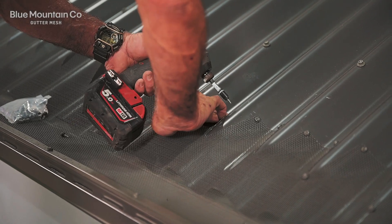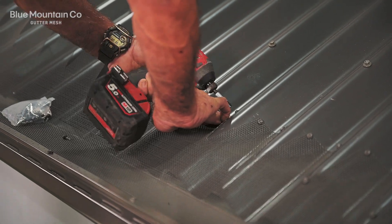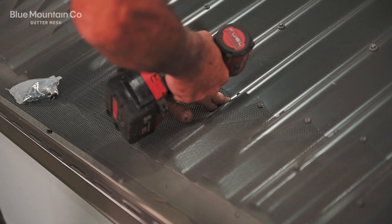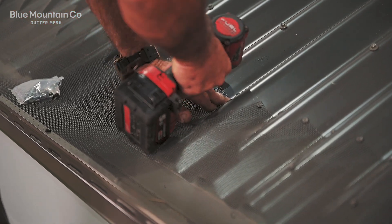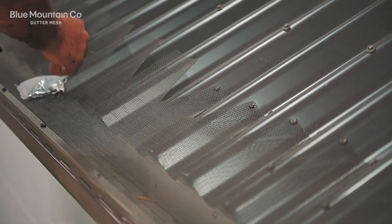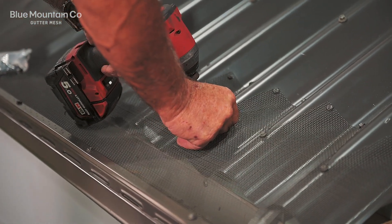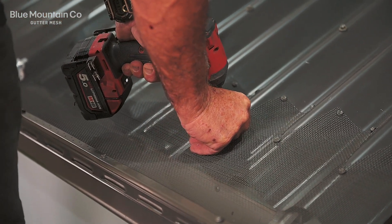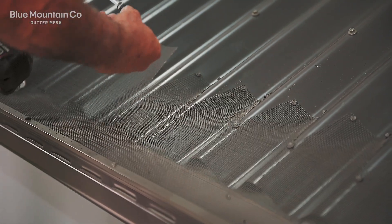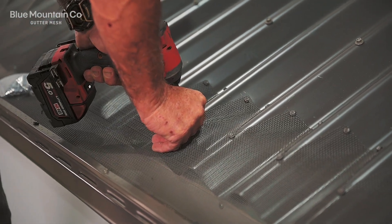Next, we're going to put a screw on either side of the corrugation where we've made those slits. You can see here that because we've put a v-notch, the screw is sitting a little bit lower down on the corrugation — that's okay. Probably better is to just put a straight slit, then that screw is going to sit a little bit higher up on that corrugation. It's always best practice to keep screws on the very top of those corrugations — you never want screws sitting in the pan, which is why we've got this technique. You can see we've also put the screw at the end of that v-notch or slit, which is going to help everything hold together nicely and keep the mesh really tight up against the edge of the roof sheet.